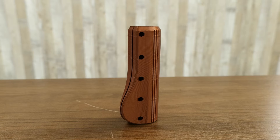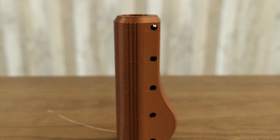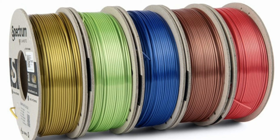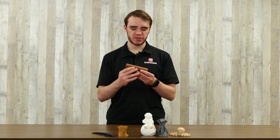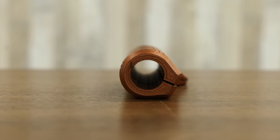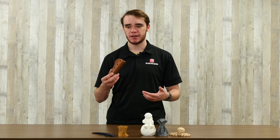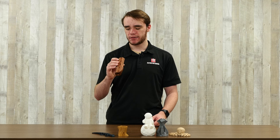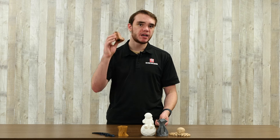The next one I have here is silk PLA. Silk PLA is sometimes a little bit more tricky to print than regular PLA — a little more particular with temperatures and cooling, so you have to dial it in a little better. It's not hard to print; still much easier than some other materials, but just not quite as easy as PLA in some cases. The nice thing about silk PLA is that when it finishes, it has a beautiful shine to it — not reflective, but just shiny. I usually use silk PLA if I'm printing a gift for somebody because it looks pretty and people are usually impressed. It's generally not as strong as PLA, so for purposes where you need strength it's not ideal, but it's great for little knickknacks because of its nice surface finish.